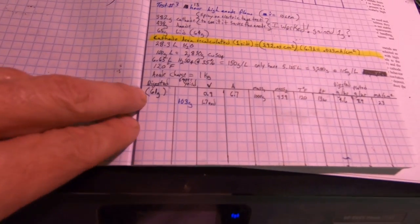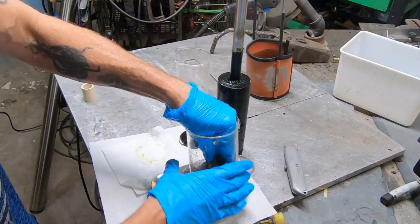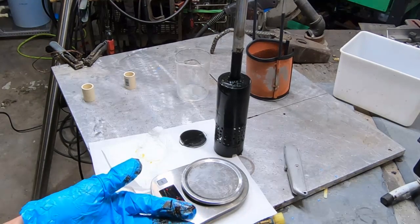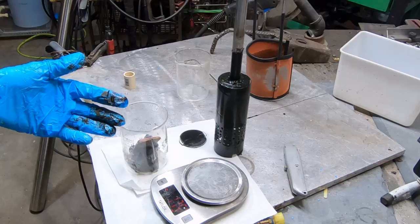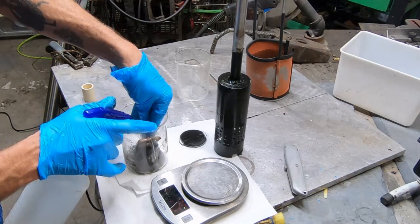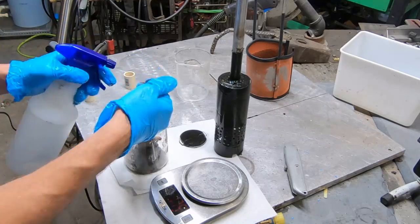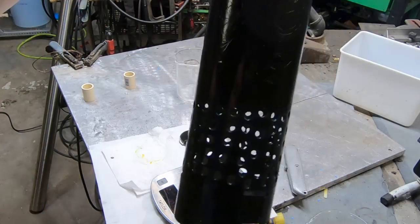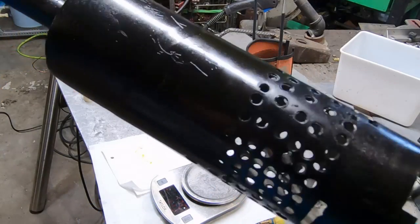We digested almost as much metal as we did in the previous test, which was at 13.7 amps and 1.5 volts. This one definitely has some sludge on it — I'm going to stop touching this. I'm getting valuable sludge lost in the mix here, and I don't want to do that. What I'll do is put these in a container and wash this material by shaking it violently. This is a very valuable anode sludge — just good practice to not lose any of it. Coating the exterior of the anode basket definitely helped prolong the life. You can see here these ridges where I wrapped it in plastic — it inhibited erosion significantly. This is not 316 stainless steel, just some generic 304.